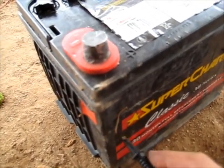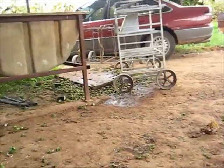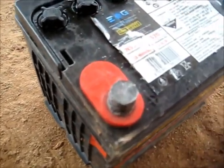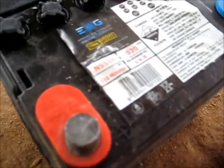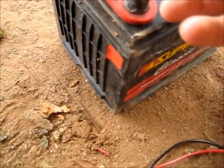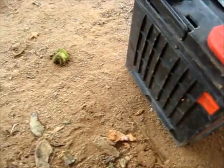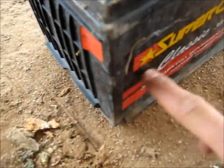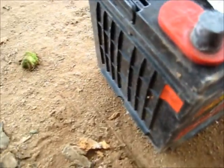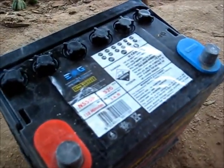The fluid was neglected and got down too low. It had been run dry, left sitting dry, and charging while in that state. The terminal was all full of gunk — corroded and covered in that green buildup that happens when acid tracks to the terminal. That will affect the connection so you don't crank properly, and you can't charge the battery properly. Once the cell gets too low and doesn't charge properly from a dirty connection left like that, not only is the battery going to be weak but it'll do damage to that cell.